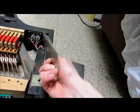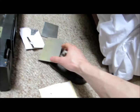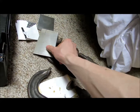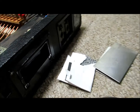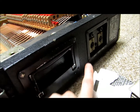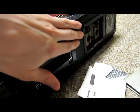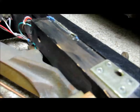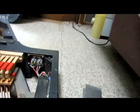And you're always going to want these, and the reason why is because this prevents these clamps from leaving indentations in the wood, because they definitely will. You're putting a lot of pressure. And as you can see, because I put the cardboard and everything, didn't add any more scratches, because this thing was already scratched up, but I didn't add anything else. No more dents, nothing. And on this side, absolutely nothing. It turned out really well, and I'm happy about it.